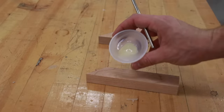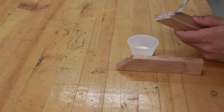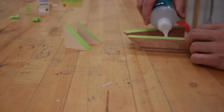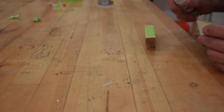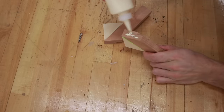In gluing up a standard miter joint, I want to talk about a technique called sizing. Sizing is when you seal off the end grain pores of a piece of wood using a glue amalgamation. I use a mixture of yellow glue and water, thinned out by somewhere in the range of 30% to 50%. I brush on that glue solution and let it dry for 15 to 20 minutes. While it's drying, I create gluing blocks — just two triangles that I glue onto the miter pieces so that I have direct clamping pressure.